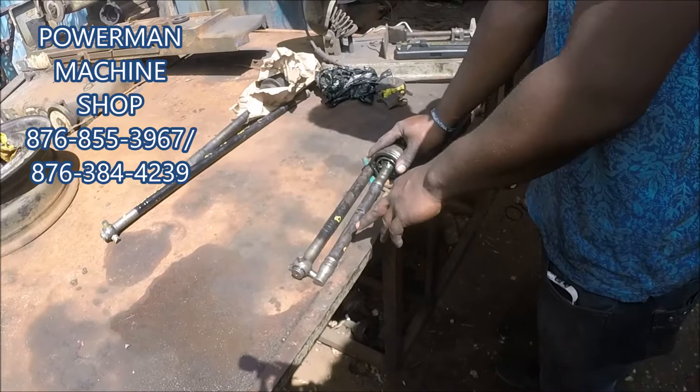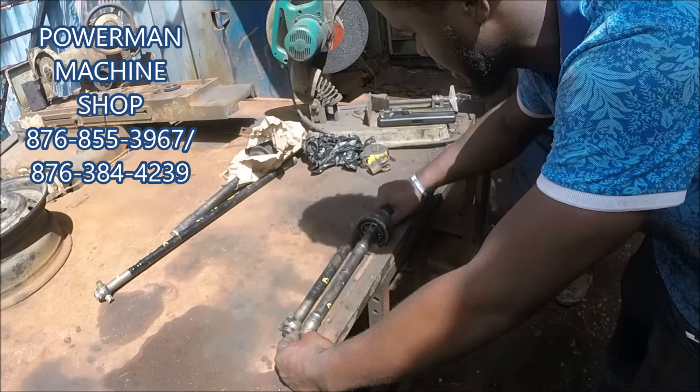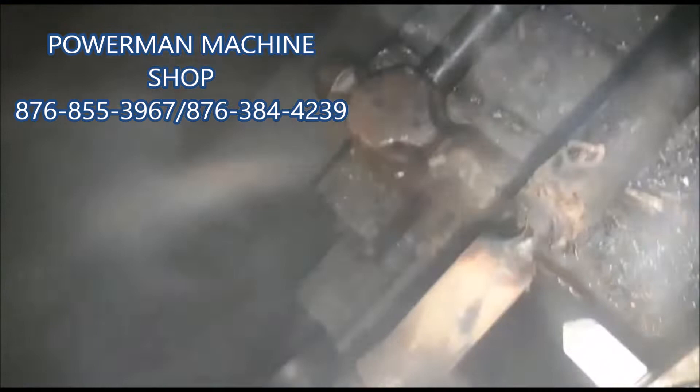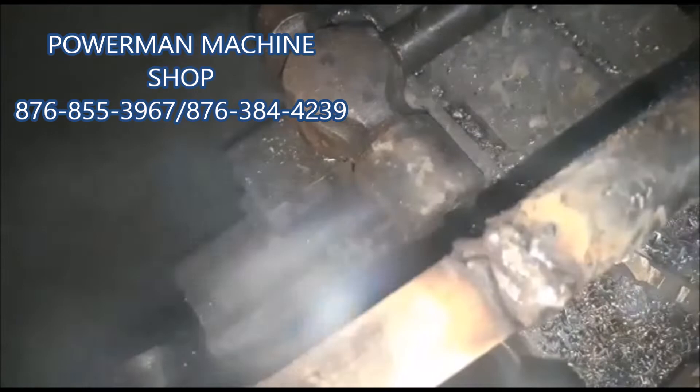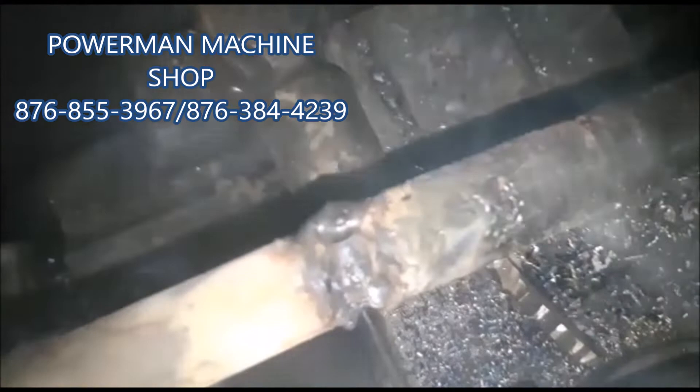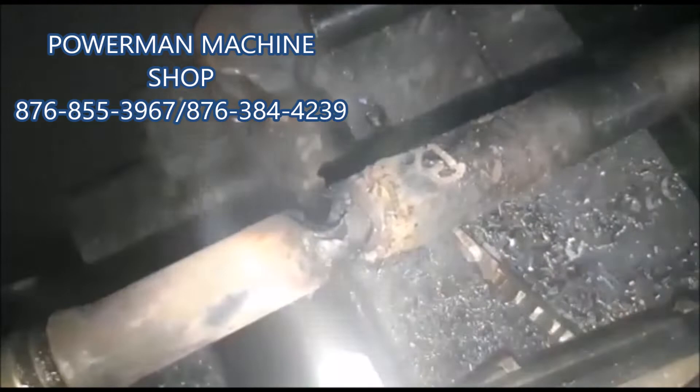We have to weld it between two centers so we can get a level, straight axle back. With my welding — don't grind it out, burn it out and preheat the material. You see how the tin burns out — all those spaces are going to come back. Then you use welding to build up those spaces. Already preheated, so everything is set. I'm going to do the X-weld — this is the strongest welding technique when it comes to axles.